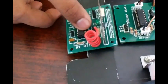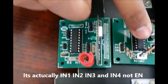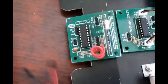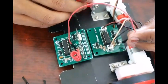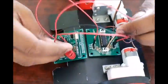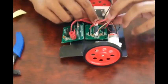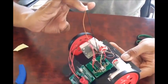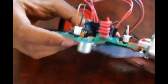This is the receiver and this is the motor driver. The ABCD pins — that is D1 to D4, or A, B, C and D — should be connected to the motor driver pins IN1, IN2, IN3 and IN4. I will be using jumper wires for this — these are both-side female jumper wires. I will plug one here and EN1 here. Similarly I will connect the remaining wires from the decoder to the motor driver. Then I will power this circuit — I have a 5V output here, I am going to plug it in. It matches the color code, so now this one is powered.